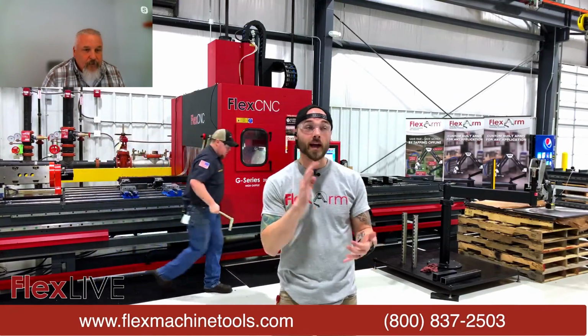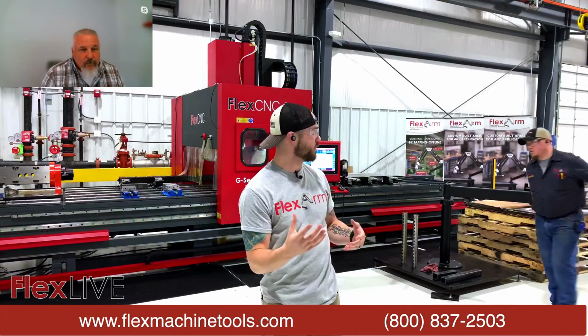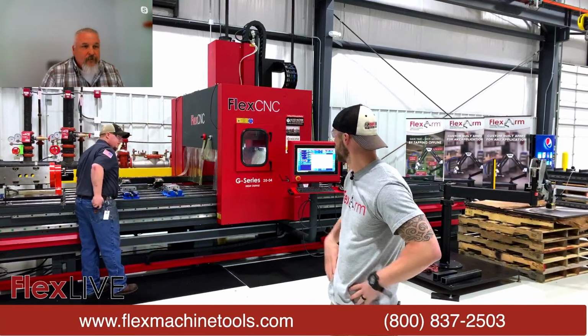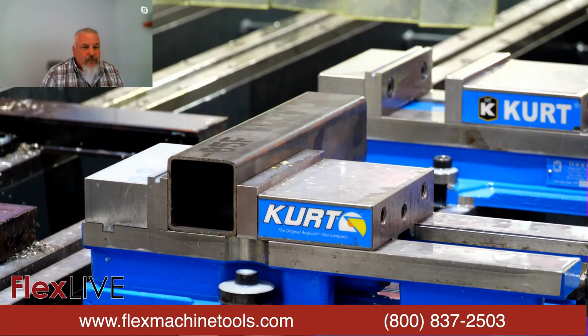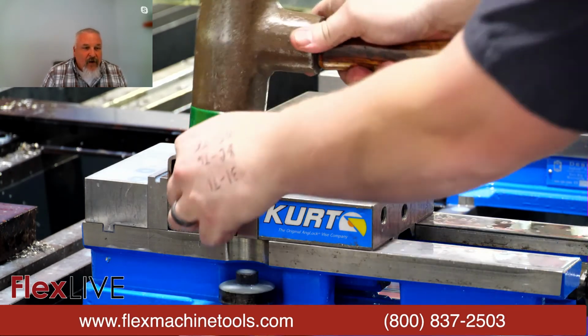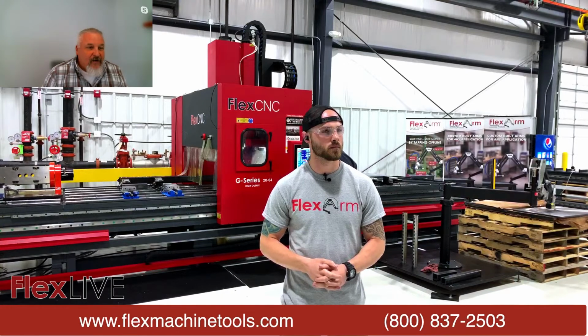There we go, right on. So I know we just got done going through the 1/2 inch, then we went to the steel tube, the 2.5 by 2.5, did a little bit of flow drilling as well as form tapping. Aaron, what's next for us in this demo? Here I got another piece of the 2.5 inch by 2.5 inch, and we're gonna bring out the 31.4 millimeter flow drill that's gonna form a collar, kind of like that first one did on the pipe. This is for a 1-inch NPT, fellas. So it's a little bit bigger hole. Just shows you some variances there. Like I said, we go all the way down to that 1.2 millimeter diameter, and this is a 31.4. So anything in between, we got you covered.